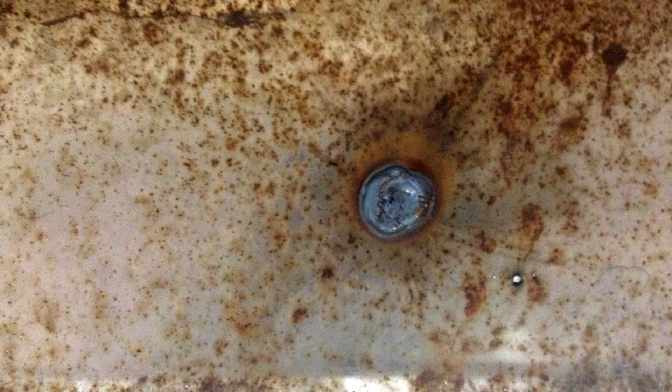Also on the backside, if you ever weld the back of a hole, I've had wire sticking through and a big mess back there. Well, you don't have any of that whenever you use this copper backing plate. It leaves a smooth, level surface — really clean. And that's less room for corrosion, since you're not gonna have jagged wires and things like that sticking through the backside.